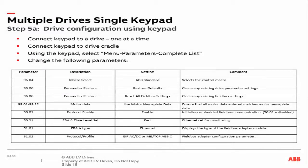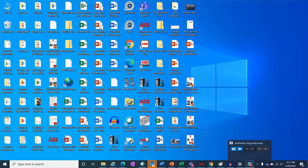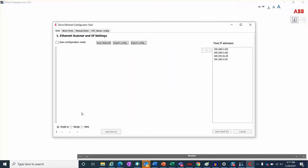Here is the complete list of parameters that need to be changed at each drive while using the single keypad. You will have to take the single keypad to each drive, one at a time, to make those parameter changes. If dealing with identical drives performing identical functions, you can back up the parameters to the drive's keypad and then take the keypad to load them to the other drives. Be aware that it is good practice to refresh the field bus settings after you have configured all of the parameters in groups 50 and 51. We can now proceed to open Drive Composer. When Drive Composer starts up, click the Ethernet Enable checkbox and click Comm Settings to search for the drive's IP addresses via Ethernet. Be sure to enter and save the drive's IP addresses manually so that Drive Composer can recognize the drives.